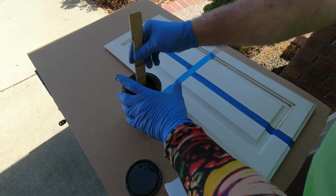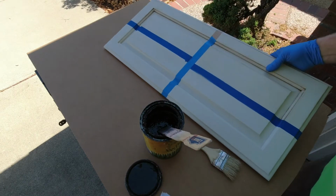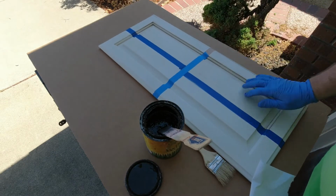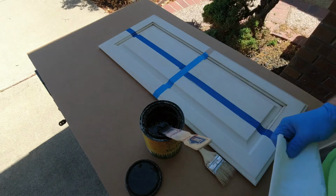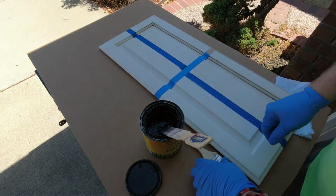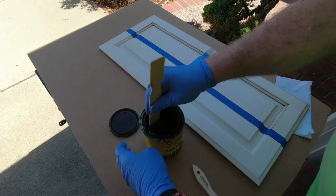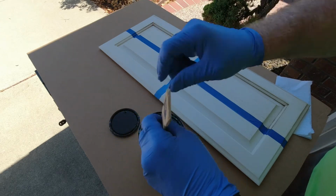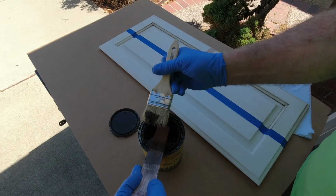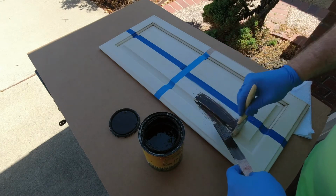I've watched a couple videos on it. I don't have any idea what I'm doing. The Van Dyke brown glaze is how I antiqued these two sections. So we went from the white paint to the wax and the antiquing. And the whole idea behind the Ceruse process is to pull the grain out. When I saw how they did it, I was like, wow, that's a tremendous waste of glaze.